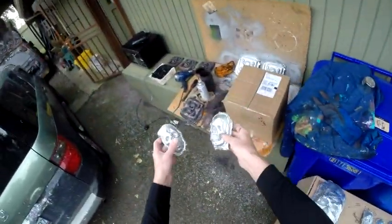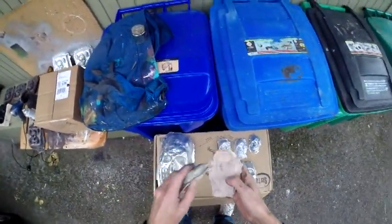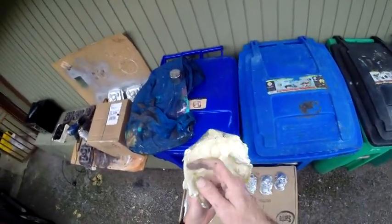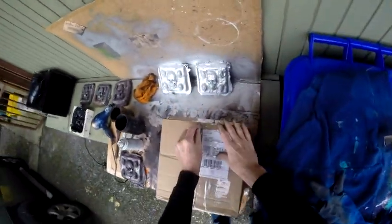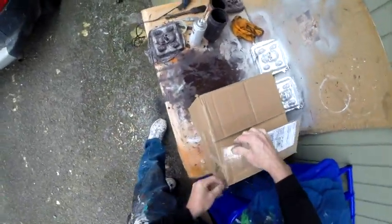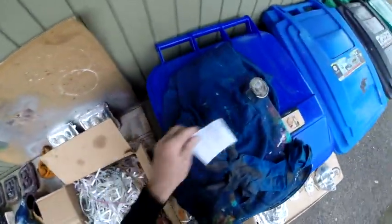I made a bunch of these - they're the same characters but independent hard resin pieces. I put polyurethane resin in first and then Bondo inside. This one just has the resin without the Bondo yet - just a thin layer of resin. Bondo is cheaper than the resin, so that's why I use it to fill. I looked all over for the best deal on polyurethane resin and this stuff dries really quick - cures in about three minutes - and has low odor.